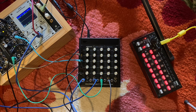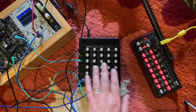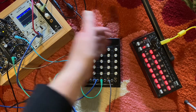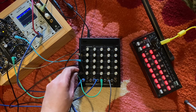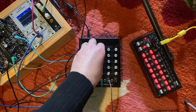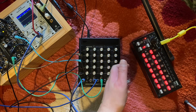But also this can be really useful in quite a larger system as well. The way these are designed is that you're able to chain multiple of these together. So if you want more output channels, you can chain two of these together and each of the inputs would then be available on 10 channels. You can use these as breaking jacks — if you plug a jack into the second one, that first signal would be available on five channels and the next on five.